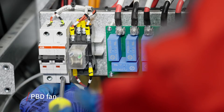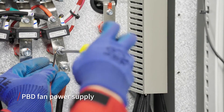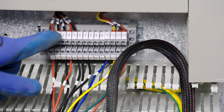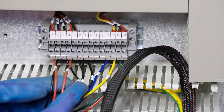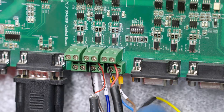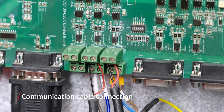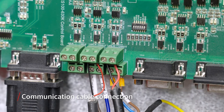Find a 1.5 square millimeter cable and connect it to the L3 end position at the AC end of the PCS. Connect the wires in the bypass to the wiring terminal block of the PCS according to the sequence number. The communication cable needs to be connected in the right order and cable sequence. Check the silk print at the PCBA terminal.